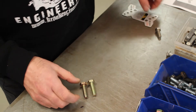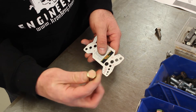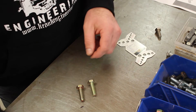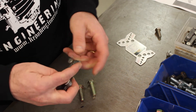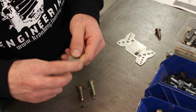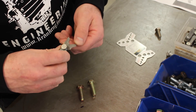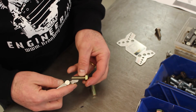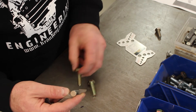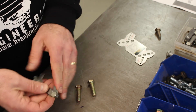For the fine thread example: it has an 8.8 marking so I know it's metric, fits in a 10mm hole so it's M10, but the thread form is different. Going through the leaves on my thread gauge — 0.75, 0.8, 0.9, 1 — and sure enough it matches up on the 1mm leaf. So that's M10 by 1, say by 40mm long. That's how you do it for metric.